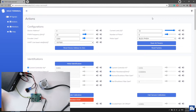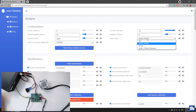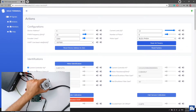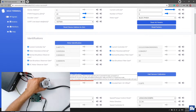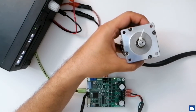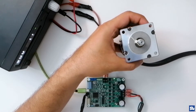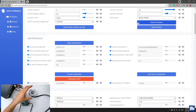I connect to SOLO in Motion Terminal, confirm the parameters are set, and verify the motor type matches the DIP switch setting. I run motor identification once to detect the current controller Kp and Ki. Then I press encoder calibration. The motor starts rotating — initially counterclockwise for about one and a half turns — then turns back. It depends on the position of the index pulse. After a couple of seconds it stops.